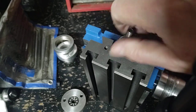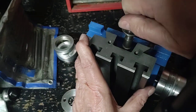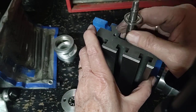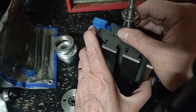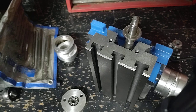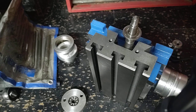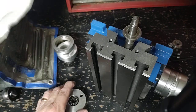And then of course you have the screw, which is binding up as well. No point in taking that out right now because I'm going to go through this more thoroughly. I'll deburr it, I'll clean it up, I'll polish it up, I'll take the shaving edge off here and here, and we'll go from there. But that's at least a look at the starting point of the inside of these things.